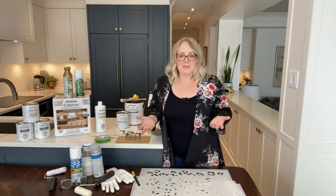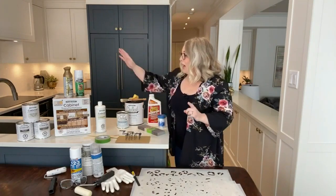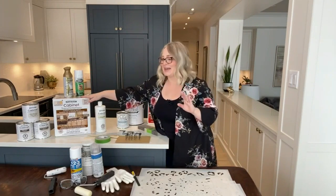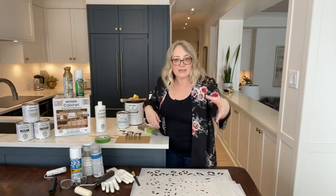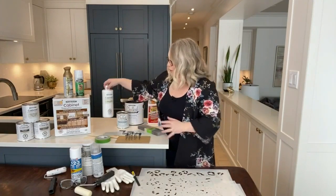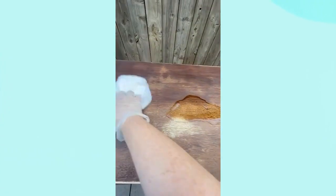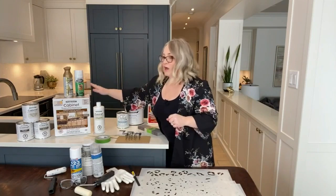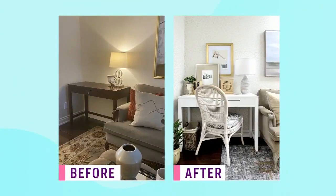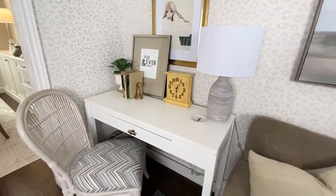This wasn't the application to use leftover wall paint — I needed something with built-in durability. I ended up using one of my favorite products: a kit, which comes with everything you need for the makeover project. You don't have to research what to use to clean it, paint it, or protect it. Everything is inside, including a product called de-glosser — basically a liquid sandpaper. You wipe it down, don't have to rinse it, and it micro-etches the surface so you can apply your bond coat and top coat. I finished that project in one day, and the kit is tintable — I used white, but it comes in many colors.